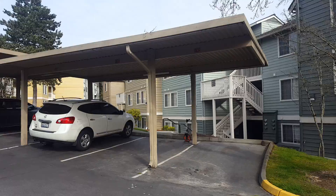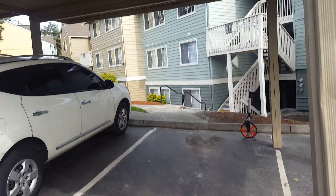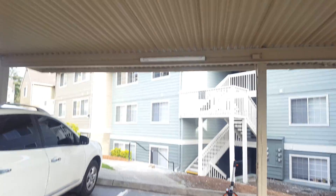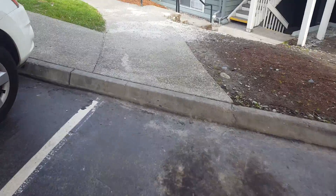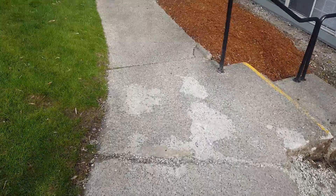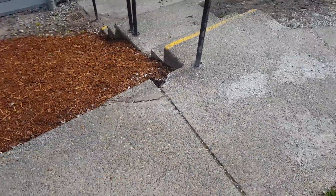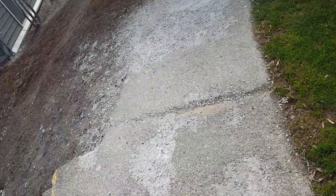If you go through this carport at stall 152 and stall 153, you've got about a nine-foot clearance to the top here. I'm saying that because we probably need an excavator to come in here. We need to replace this concrete right behind the curbing, and then go a foot past this joint and saw cut. They just want a saw cut right here — we'll take all this out. That is a four-by-nineteen.